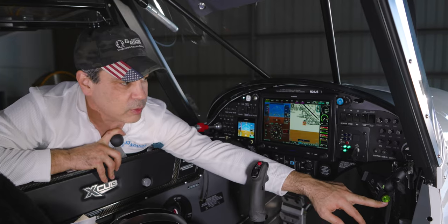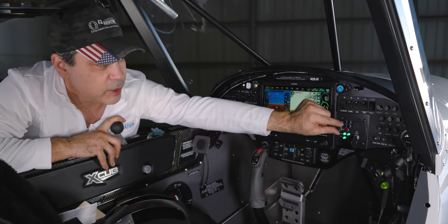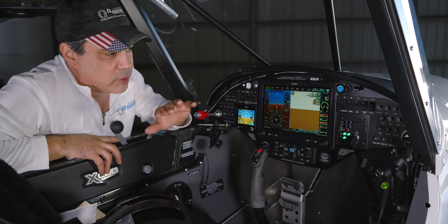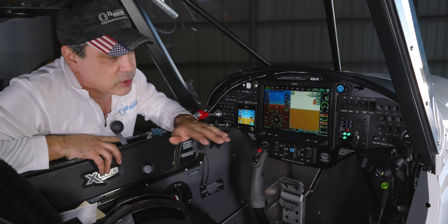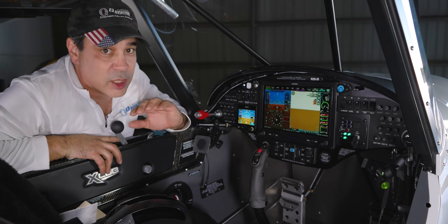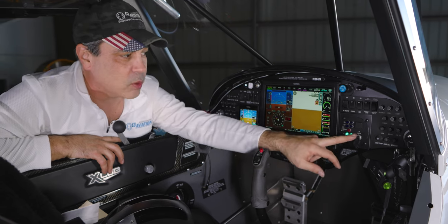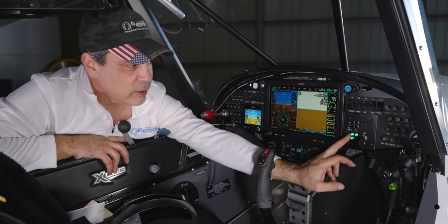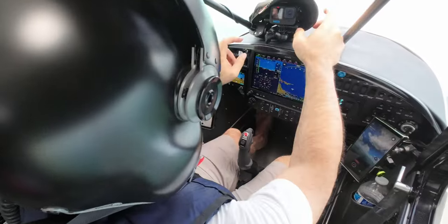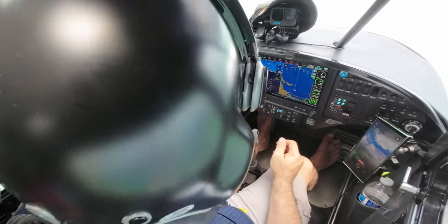We have a phone mount and our controller for the water rudders — up and down. Now the gear control system is really great. It's audible and indicating. We have four ways to verify gear position. Four blue lights mean gear is up for a water landing; four green lights mean gear is down for land.